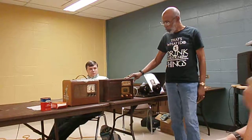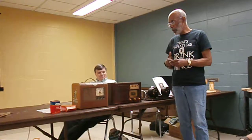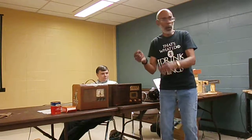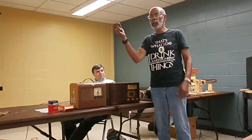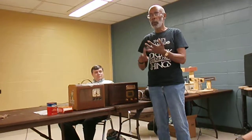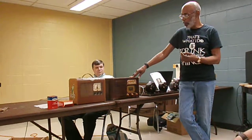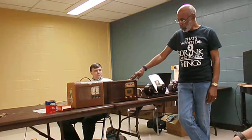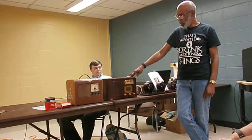Great radio. Like I said, it had rubber wire and it had cloth covered wire. Thank God for cloth covered wire. But pretty much every rubber wire in there was falling apart, especially red. Is red the worst wire? Yeah, yellow is just as bad. Oh my God, it was horrible. I mean, it crunched. And then farther down the wire, it was spongy. You know, it depended on, I don't know, if it was heat or whatever. But I think back in 41, they hadn't developed the science of plastic or the science of covering wire. Vinyl.